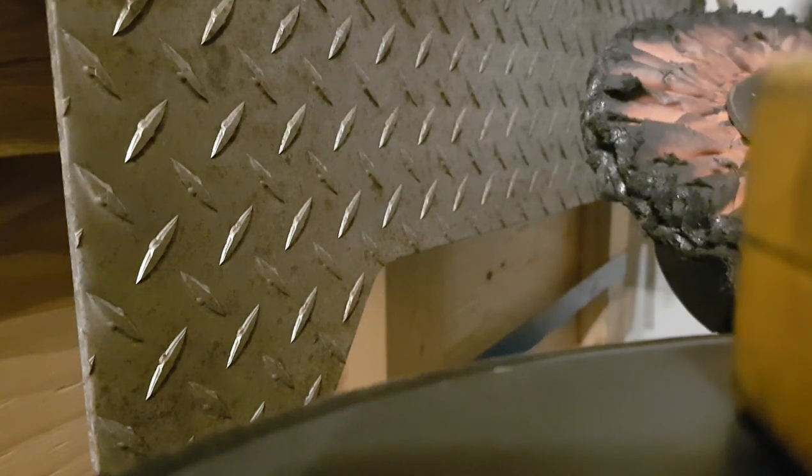what I'm going to do is take a brown bar, or brown rouge. This one's a little small. I save these scraps for checker plate and that. And I'll be running an orange pad. It's a cutting pad. It's aggressive, and it goes with this bar. You can also use a purple pad. It's a cutting pad as well, with the brown bar. There's a number of different things out there that you can mix. I don't want to go into too much detail. So anyways, brown bar today, orange pad.